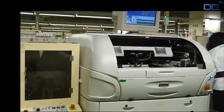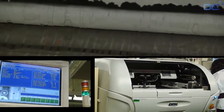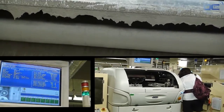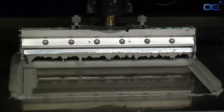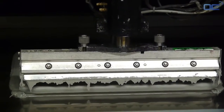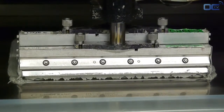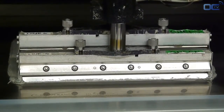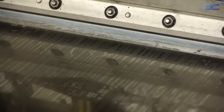Every part of the PCB that will be in electrical contact with a component gets a special solder paste pass. The solder paste acts like a glue for all these chips before going to the reflow oven for definitive soldering. In that way, every small component can stay in the right position before soldering. As you can see, solder paste is applied only to the PCB space where you will have a component.